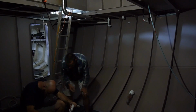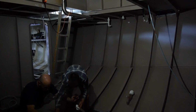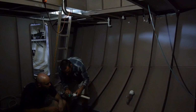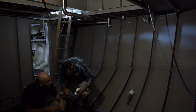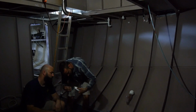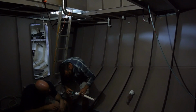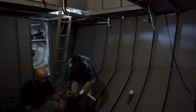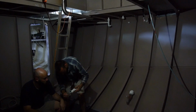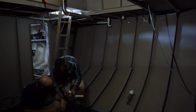I'll show you how I like to do the corners, just so it's all consistent. I'll just do one, I'll show you what I mean. So plenty of stuff on the brush, and go around painting upwards. And you're actually pulling out so that it stays in there. Does that make sense? And then I just spin around like that, get the excess off. And that way I've got a real consistent bead all the way around. You see it all the way around there. Cool.